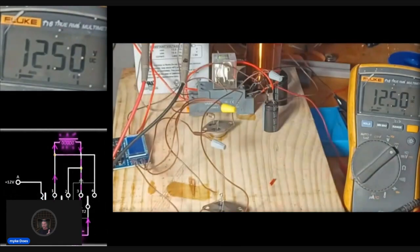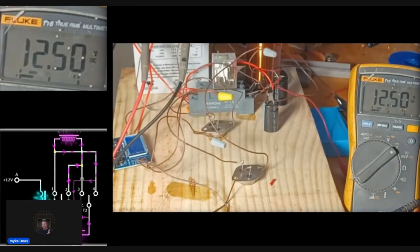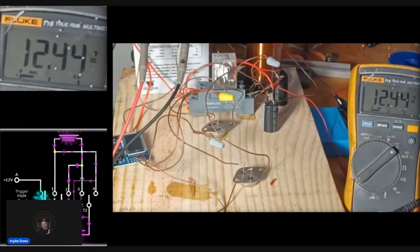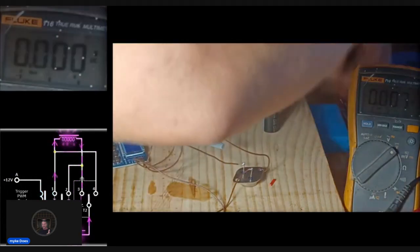The starting battery voltage here was 12.42 volts. I turned it on and it's pretty much wired up the same way with double pole double throw switching. If one of the switches did not open up fast enough, the flyback would cancel and you would not see a voltage rise as you see here. So that's the purpose of this brief interruption — to clarify that this concern is not a concern.